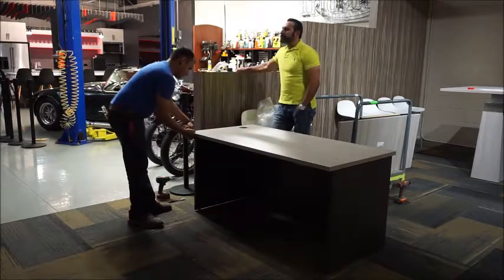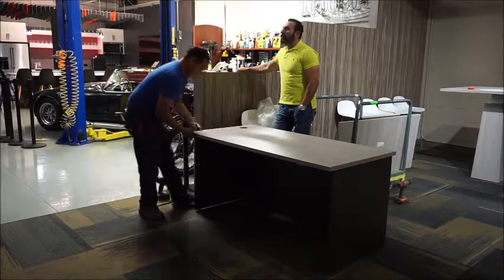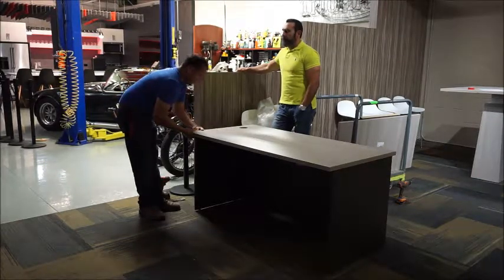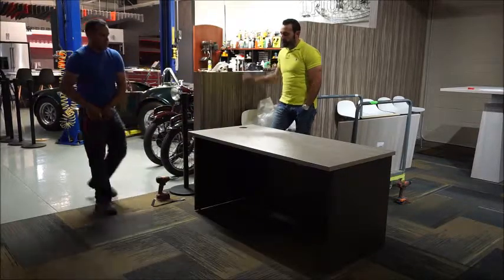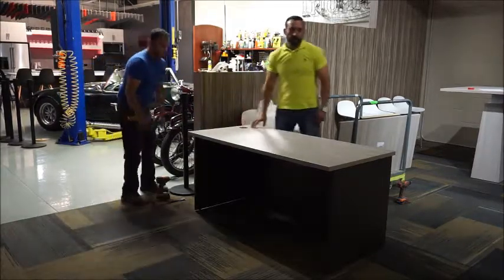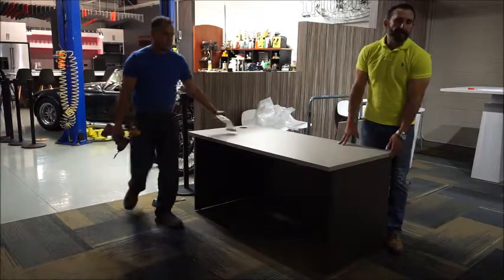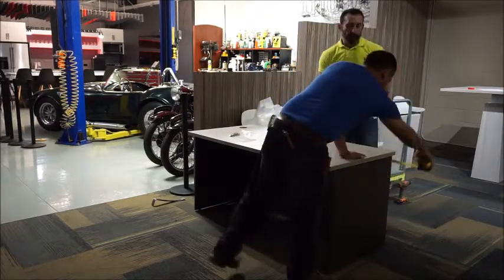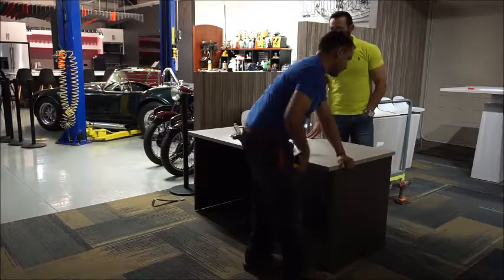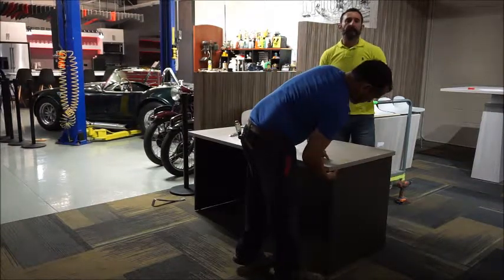The modesty is also a support, because if you have a thick baseboard that's an inch thick, it pushes that out. So you want to accommodate the baseboard. Normally, baseboard, if it is plastic, is about 1/4 to 3/8 inch. If it is wood, it's going to be 3/4 to 1 inch. So the overhang is always good to have to accommodate any of it.